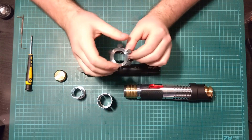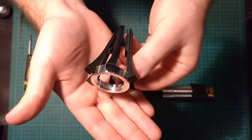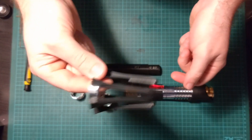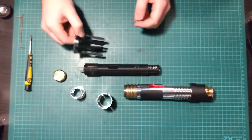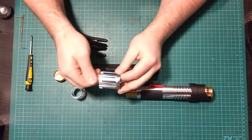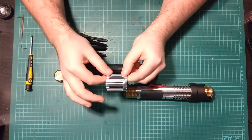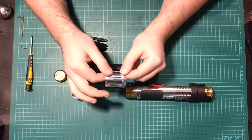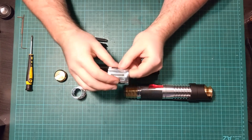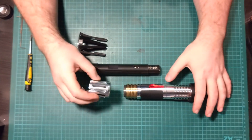So what we're going to do next is put your fins onto this ring here. You get six screws in the box which you use to assemble these fins to this ring — loosely, so they rattle around and are not on tight at all. You assemble your fins and panels onto your emitter sleeve using your desired method, whether it be glue, 3M tape, or you don't even have to put them on at all — it's entirely up to you. I'd recommend 3M tape, but if you want to make sure they never come off, super glue is obviously going to be better. Just make sure it doesn't cloud up your aluminium — this is a really high polish, so it's an absolute fingerprint magnet.